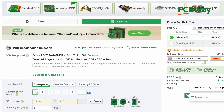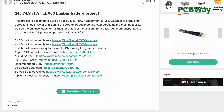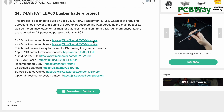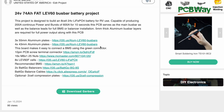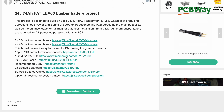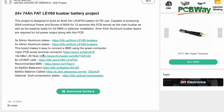On the project page, here are all the other things you'll need to finish this product. The aluminum plates are if you're going to max out the board — this is another way to stay with one ounce copper but add aluminum plates that carry most of the current, so the board only carries about 100 amps. Those are already made and ordered from a different vendor. The connectors you'll need are listed here. There are also nuts — if you bought your cells from us you don't need to buy nuts because we include them. But if you found LEV60s from other vendors, you'll have to buy the nuts using the link provided.